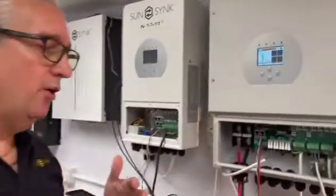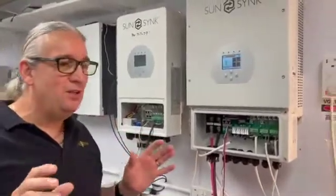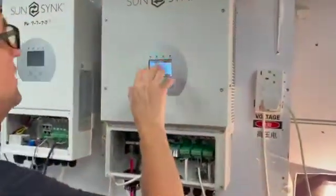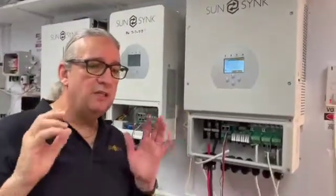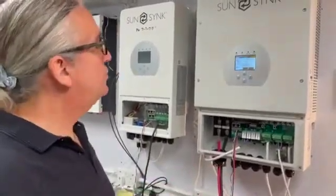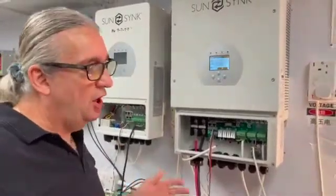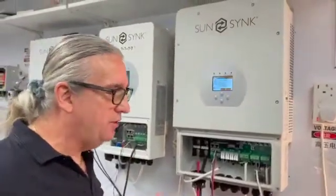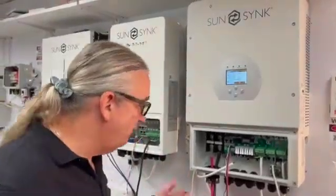The generator is very simple to use, but there are several key things to keep in mind. One is your battery — if you're using a lithium battery, please make sure the battery system is communicating. If you haven't got communication, the whole thing is out of kilter. For this demonstration I'm using voltage purely for illustration. With a large lithium battery you'd use state of charge; the test would take hours and hours, so I'm just showing a quick demonstration of how the unit controls the generator.